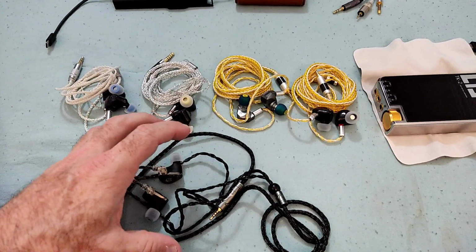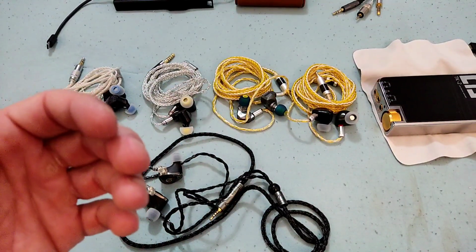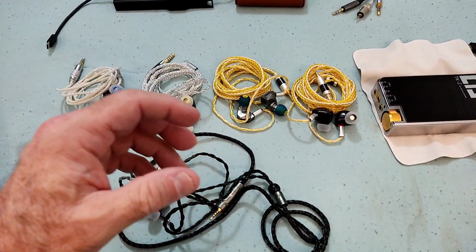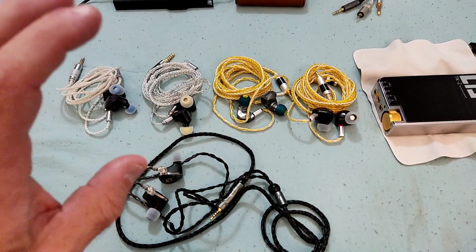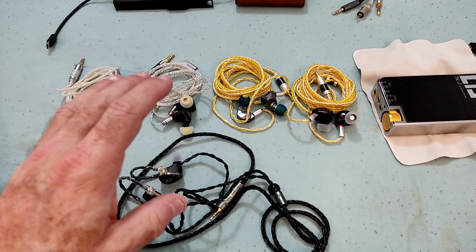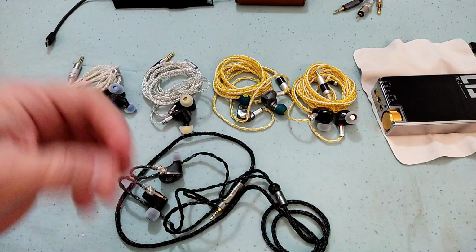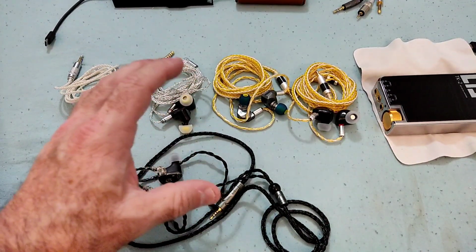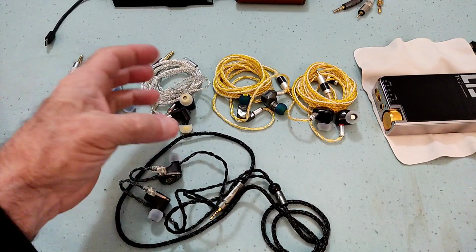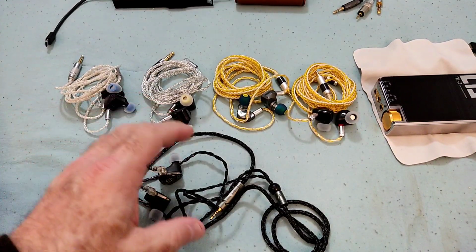By nature of the way that this has been tuned, you lose a little bit of that, let's say, bleed into the mids, which many times helps with its harmonics, helps to complement things and just give it that little extra lushness. Sometimes we have this tendency of wanting it to be absolutely flat before it reaches the mids. So by 200, 250 hertz, it's got to be flat. Okay, fine, that is true, but at the same time, sometimes not being totally flat and allowing it to bleed slightly does help. And in this case, these two have that problem. The fact that they are being very much cut off at 200 hertz makes them lose a little bit of that mid bass liveliness and mid bass impact that we would like.